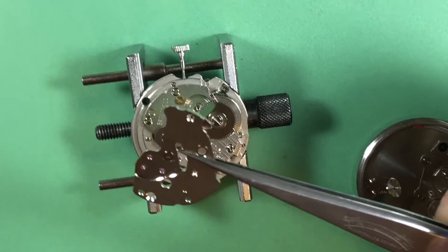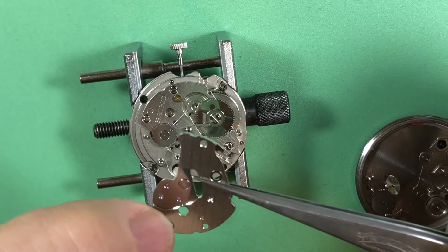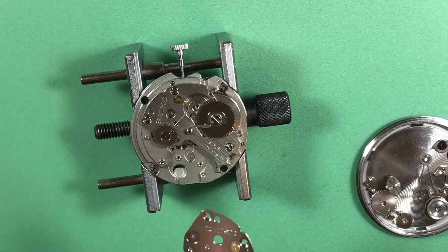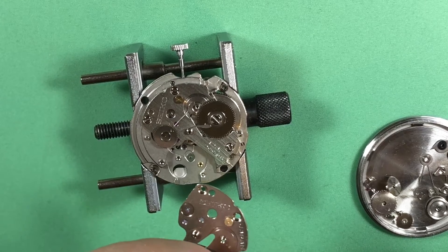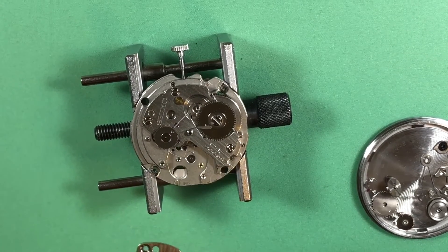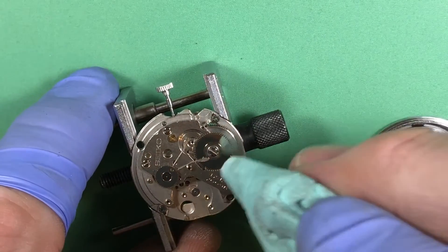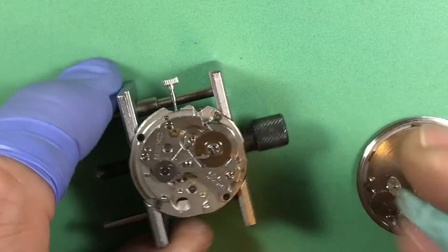The train bridge had all kinds of things wrong with it. The upper bushing was bad. The center wheel upper bushing — that was bad too. There was also this rotating screw post that the intermediate wheel sits on — the reduction wheel — that was badly worn. I could rebuild all this stuff, but at a certain point it simply became easier to replace than to rebuild. So we are running — you can see the train ticking over there.